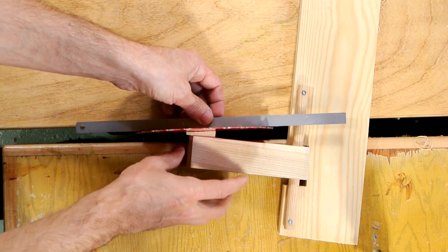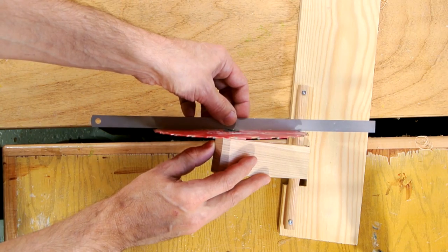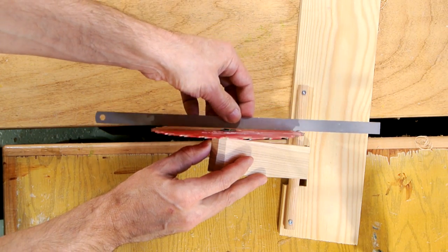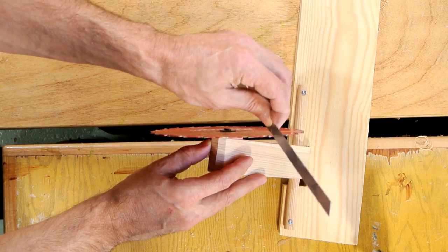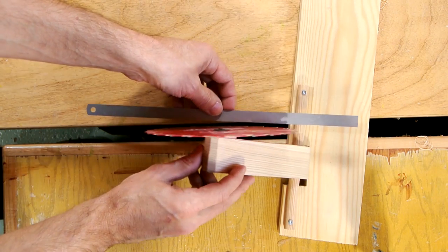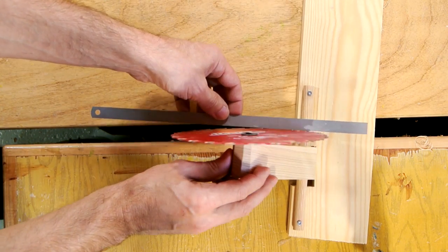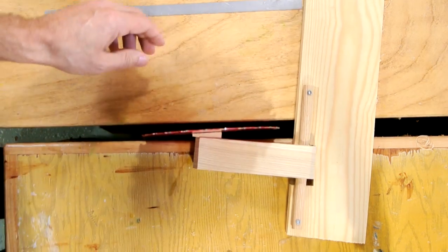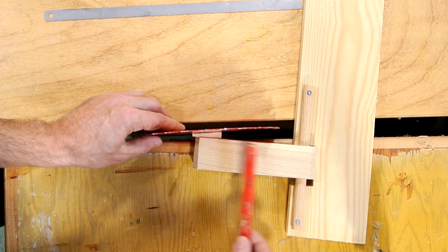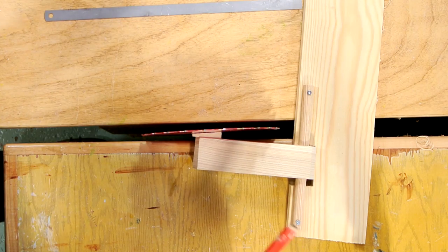But as soon as I change the depth of cut setting — I just tilt this up — the blade has actually rotated a little bit this way, and also rotated this way. So just changing the depth of cut setting will completely change the runout and the bevel angle setting. If this axis here is not parallel to this axis here, it just messes everything up all the time.